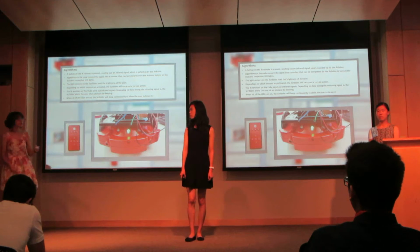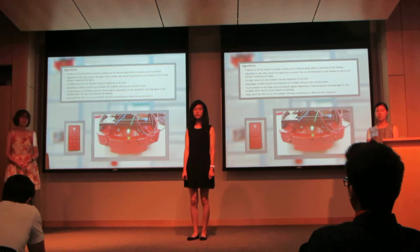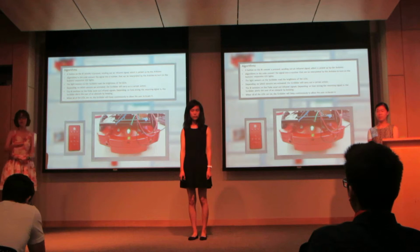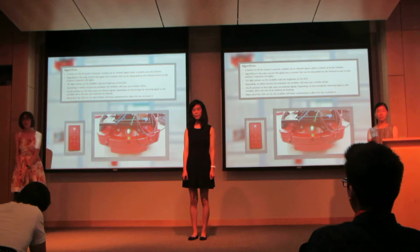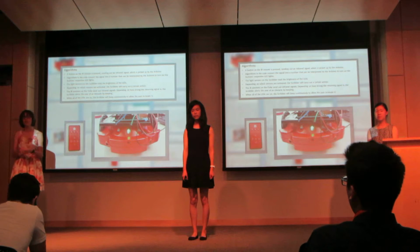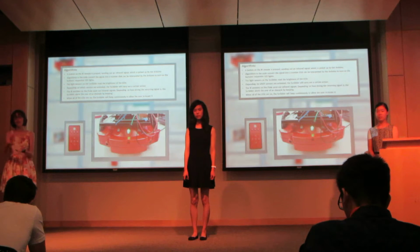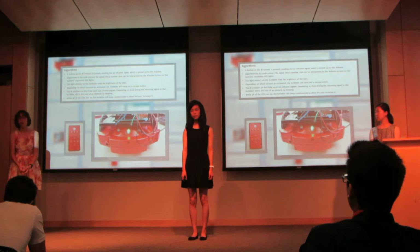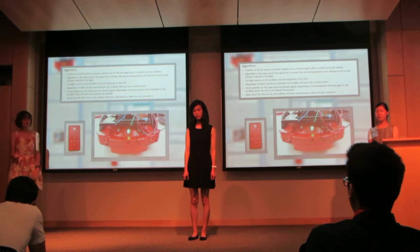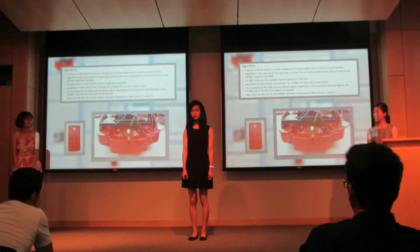We place the LED lights in front of the Scribbler's built-in light sensors like this, and the Scribbler knows, depending on what combination of light sensors are activated, what action to do: move forward, turn right, left, or beep, etc. We also included a function that utilizes the infrared sensors on the fluke attached to the front of the Scribbler, which sends out infrared signals and can receive them, and depending on how much is received, it knows its proximity to an obstacle. And this tells the user if an obstacle or something else is in front of them.